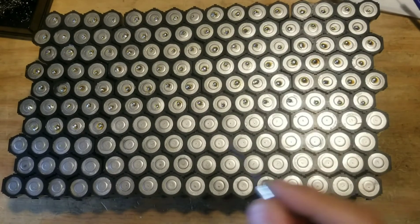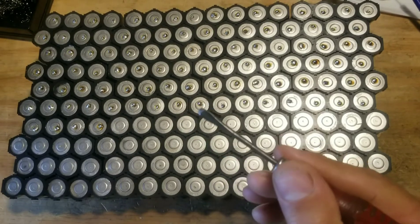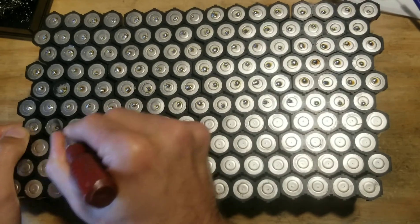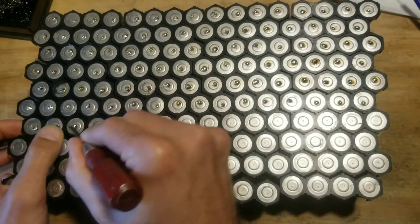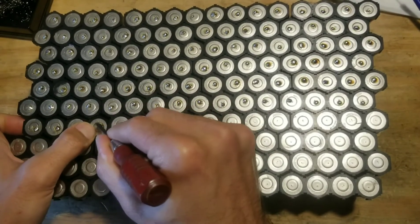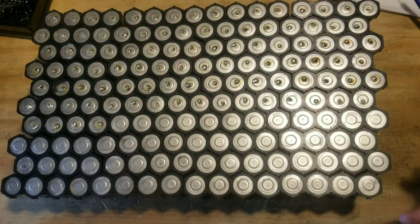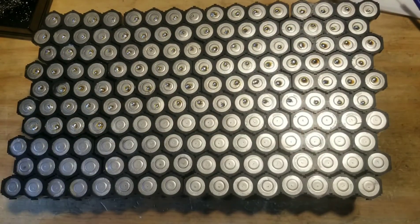The last thing I like to do is test the strength of every solder joint. I take that same sharp flathead and try to pry the solder joint off — any weak joint will just fall off in this test. That tells me I need to re-solder, use a bit more heat, or use more flux. If they all hold, they're good to go and I can solder wire into them to connect all the cells and make a strong battery pack. Hope this helps, and I'll see you later.